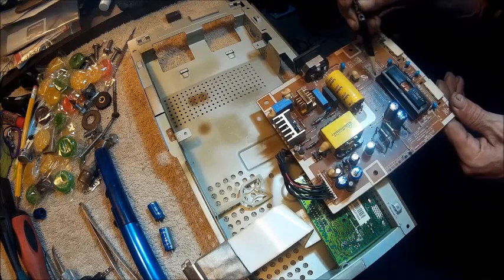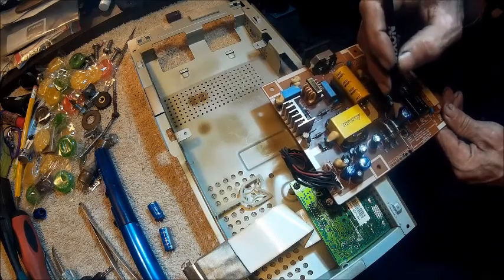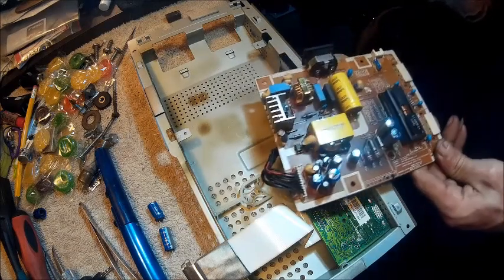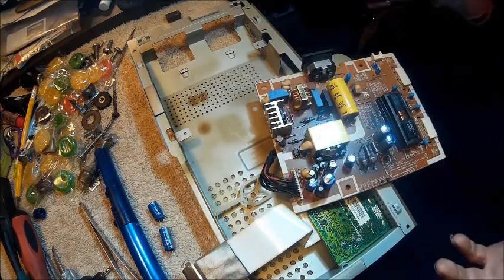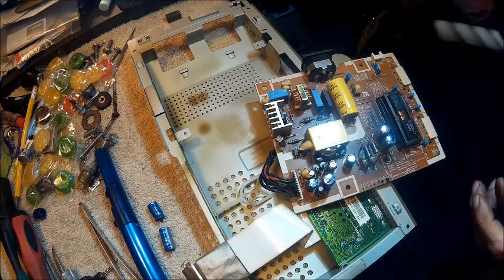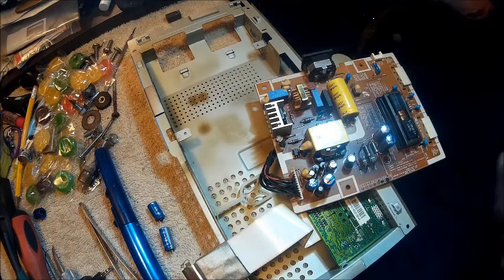If you notice it's a little dark right here in this area — that's a sign of heat, and a lot of it. These diodes here look like they've gotten pretty hot around them too. I don't know what happened today, but my monitor's not working. It had power, the computer detected it because it beeped every time I plugged it in, and the blue power light on the front was flashing. Every time I hooked it in it would sound like it's actually connecting, and the other monitor indicated it was switching to the main monitor.